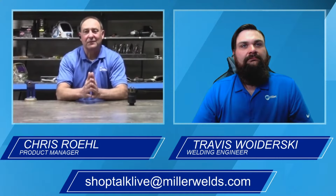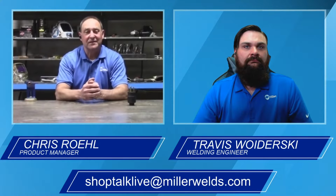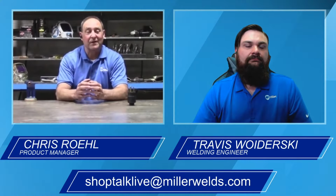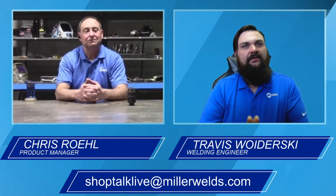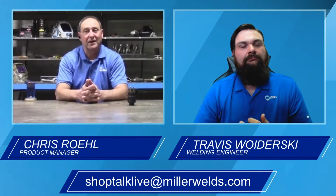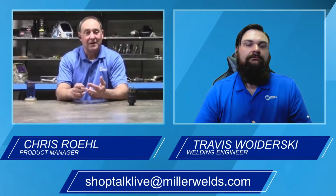We have a question regarding the Multimatic 220. What are the pulse capabilities? For TIG welding on DC, you have the capability of a frequency that goes from 0 up to 150 pulses per second. On the AC side, we have the capability of adjusting our balance control and also the frequency. Now, on that machine, we're not going to have pulse capability on the MIG side, correct? But if we look at a machine like the 255, we gain that. Right. As far as MIG capabilities on the 220, it's just conventional short circuit transfer, but the Multimatic 255 does have pulse capabilities for MIG, for steel, stainless steel, aluminum, and metal core wire.